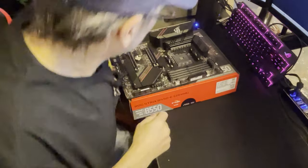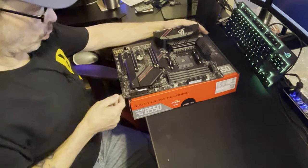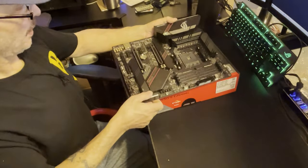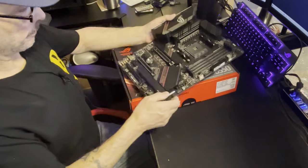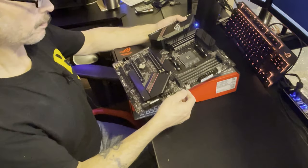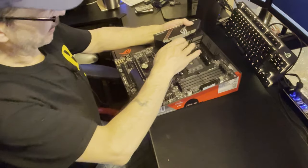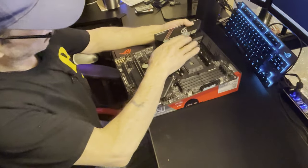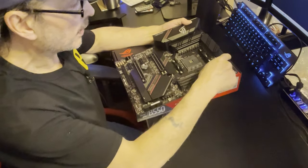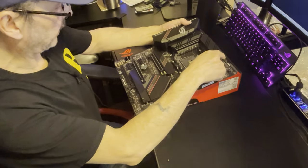Some of the features I think are definitely better than the F version: the first thing is we have a six-layer PCB, probably double copper. It has some very nice aluminum heat sinks on it. The F has one less fan connector - there's an auxiliary one, probably for a pump.